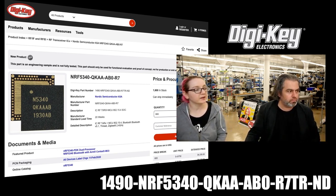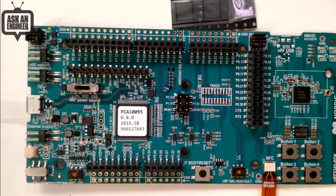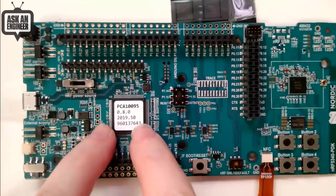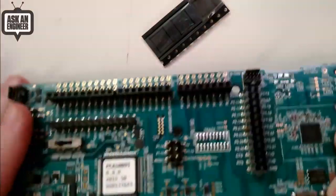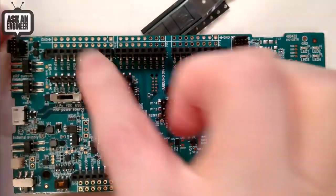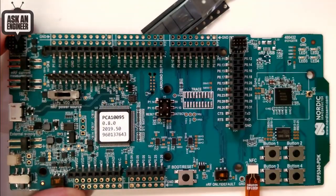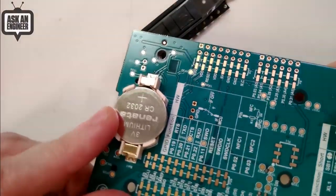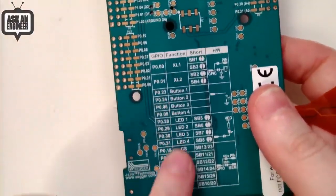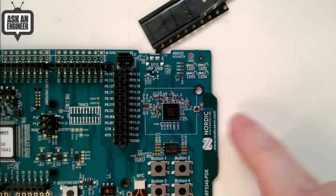If you really want to get started fast, I'll show the dev kit on the overhead — I picked one up. I really like the Nordic dev kits; they're very well-designed because they come with a SEGGER J-Link built in — they licensed it, so you've got programming and debugging built in. It's got an Arduino Uno-compatible breakout area, power source selection, a coin cell holder for low-power work, really nice documentation silkscreen, and over here the chip. It's also got a little port you can use for measuring efficiency of the antenna and radio.